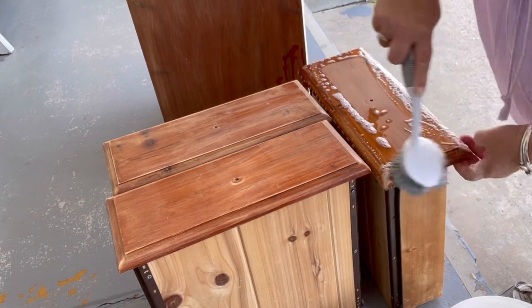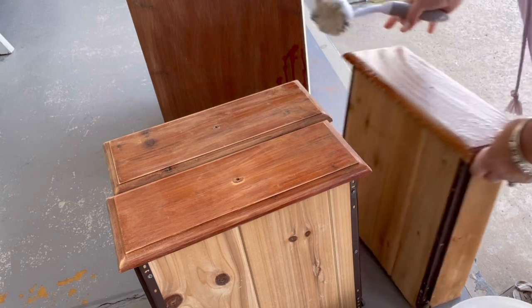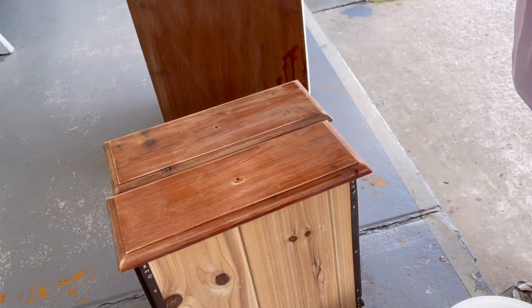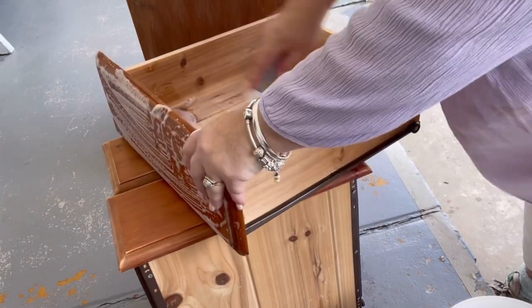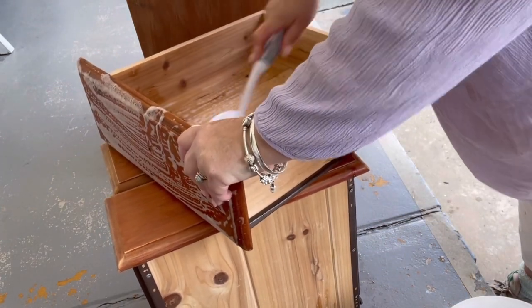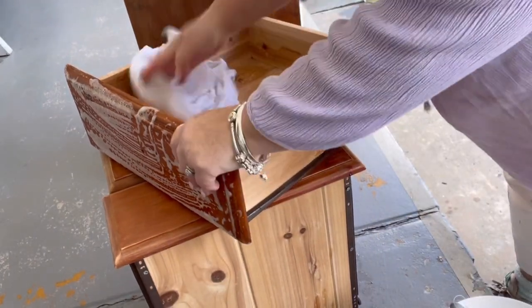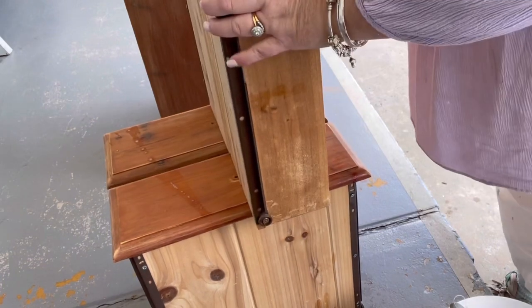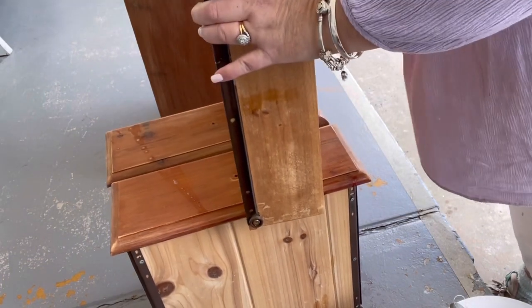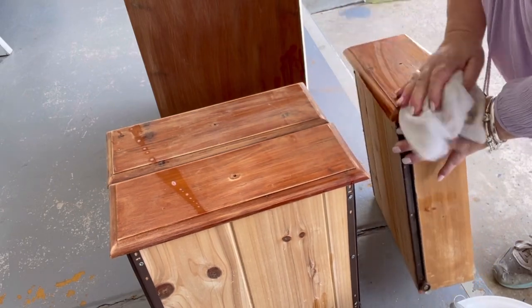Now we're going to give her a wash. We're going to use Lemon Myrtle Cleaner by Pureco. We just get a warm bucket of water, 3 pumps of the Lemon Myrtle Cleaner, and give it a bit of a swish to mix it up. I'll also clean the inside of the drawers when doing this, so when I hand the piece over to the client or the customer, it's nice and clean for them and ready to go. Once we've cleaned it with the Lemon Myrtle Cleaner, I'll get a clean, damp cloth and wipe off any residue left behind from the cleaner.